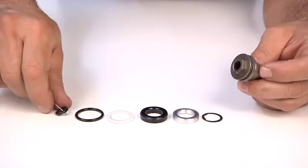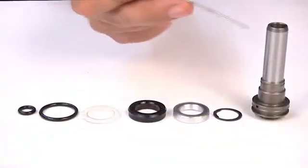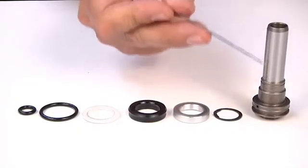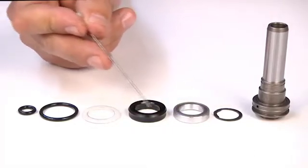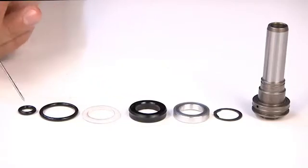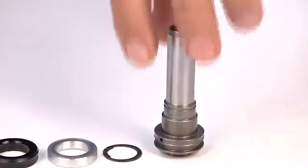Check the stem roughness, which must be equal to 0.2 Ra, to guarantee hydraulic seal. Make sure that all components are in good conditions, in particular, the internal and external O-ring gaskets, and the balsal seal. Important, we recommend replacing all the gaskets in case of machine overhaul.